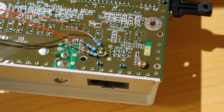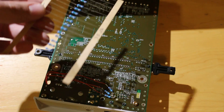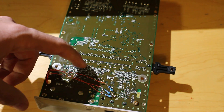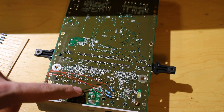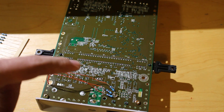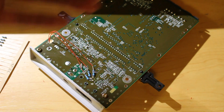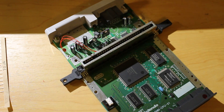So basically you're taking the RGB signal from the processing chip on the front, enabling RGB, and linking it directly back to the video output on the back. You're just dotting some I's and crossing some T's. You find three points, solder a resistor to each, solder wires to each resistor matching green, red, and blue — that's really all you do. It's extremely simple. For $22 overall — $20 for the system with two controllers and cables, and $2 for parts — I now have a modded system with better output.